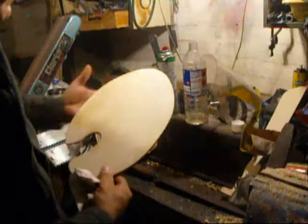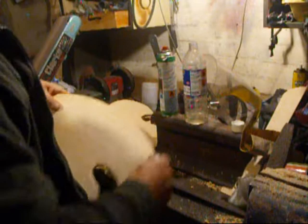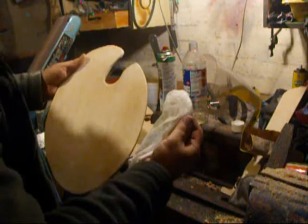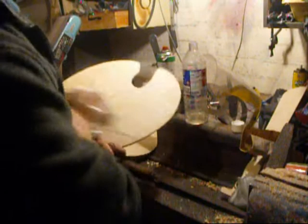What I'm doing now is using some white spirit on a cloth and just cleaning up the wood, getting rid of all the dust that could be on there and any finger marks as well. Because the varnish won't take if you've got a sort of greasy finger mark on it. So it's dust free and oil free.